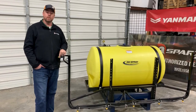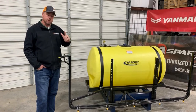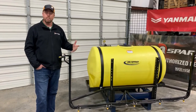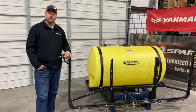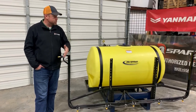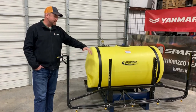Some people will use just a boomless nozzle to spray a fence row or a ditch, and some people even drive down the middle of a road and use both boomless nozzles but not the center section, spraying both ditches at the same time. And maybe if you've got a bad spot where you missed some weeds or they're just thick in that area, you could actually just shut off the outside boomless nozzles and just spray with the center section. So there's a ton of things you can do with it — it just adds a little versatility.